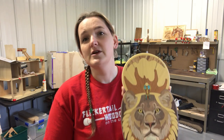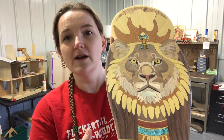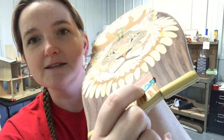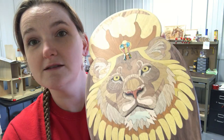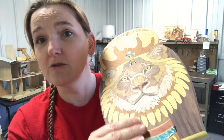What I'm working on today is finishing up an intarsia piece. This is Sekhmet, the Egyptian goddess of motherhood and battle. What I need to do today — you can see a little shiny and rough part right here — is I've added some extra epoxy and turquoise to help fill some voids up here. I need to sand that down and put a seal coat over the top.